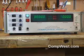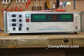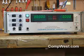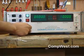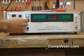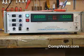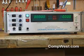The ramp time, leakage current, and test time controls can be defeated for a special tester. To operate the tester, turn it on, set the voltage, ramp, test time, and leakage current limits desired. Then press reset and test.